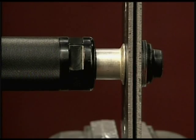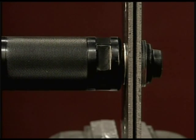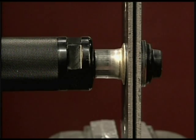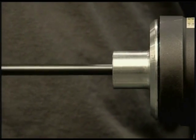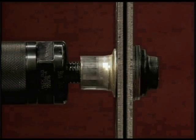Trigger and then remove the rod. Depressing the trigger will engage the power ring, starting the collar swaging process. Swage the collar until the anvil bottoms out at the base of the flange — as this happens, release the trigger. Re-insert the ratchet rod and unscrew the thimble from the fastener.